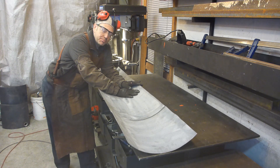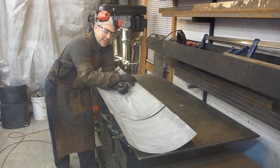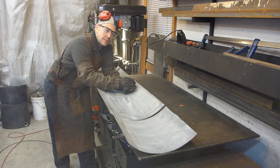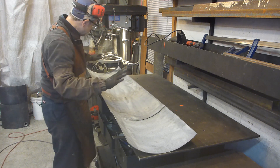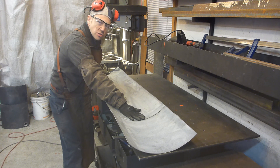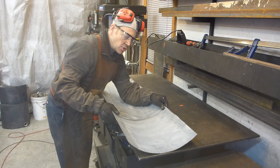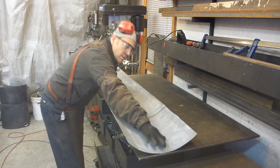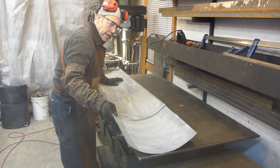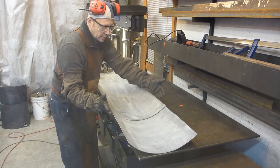We cut the tank. Dave made a good demonstration that the reciprocating saw is not unuseful — it can sometimes be useful. Anyways, that's the water heater, it's 48 to 50 inches or so. We have to put one more extension of maybe 15 inches to make the pole 66 inches. We've also got a piece of angle iron and square tubing, one and a quarter by one and a quarter.